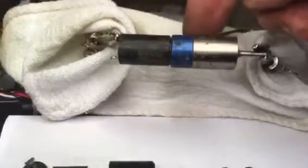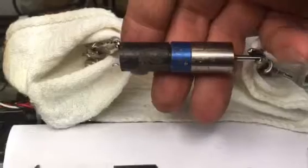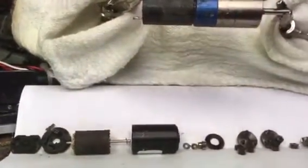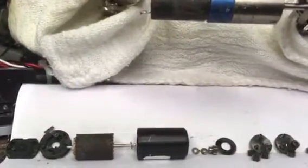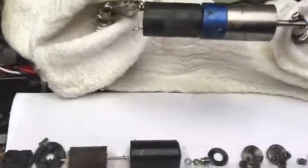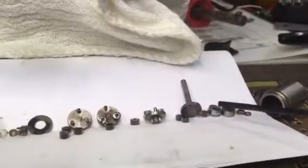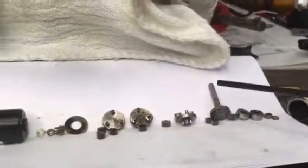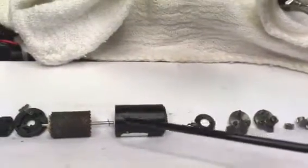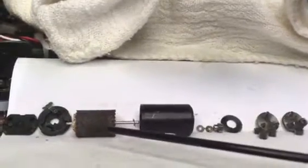This is the actual gear box and motor assembly when they're assembled together. What's happening to them is the grease in the gear box — for all these planetaries and these bearings — the grease is actually going up inside the motor through here.